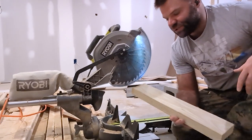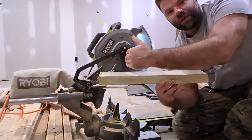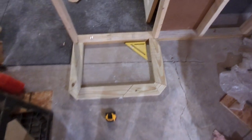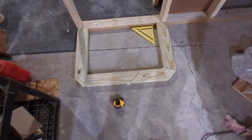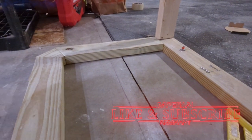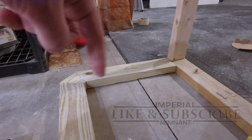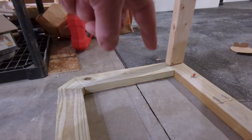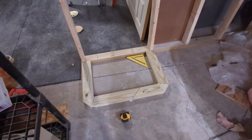I have my two pieces cut. Now I just need to cut the angle — it'll be against the floor and back wall, this piece will be the top going into the room, so it'll lay flat. I'll cut it at an angle to match and go across, and that'll be the shape. Here is the outline just laid out. I use a square to square each corner with the back wall. Unfortunately there's a crack in the cement — this basement was badly water damaged when we bought the house. There's a bit of a lift, so I'm going to shim that and attach the nail in the center on the flat part of the floor. To keep this as level as possible, I'll sink a nail here and shim the back for support. As long as this thing is straight and the shelves inside are straight, my equipment will be straight.